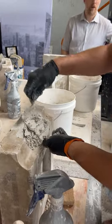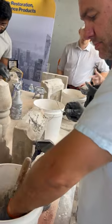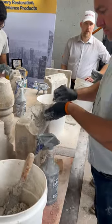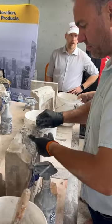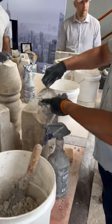What happens on our brownstone? Perfect. All right, so overbuild it? Yep, overbuild. If you can get an eighth inch overbuild around that whole patch area, that's going to make for a good finish. You want to try to avoid having low spots, because if you do have a low spot, it's going to be a texture difference.